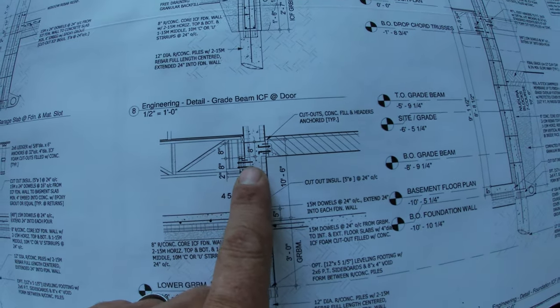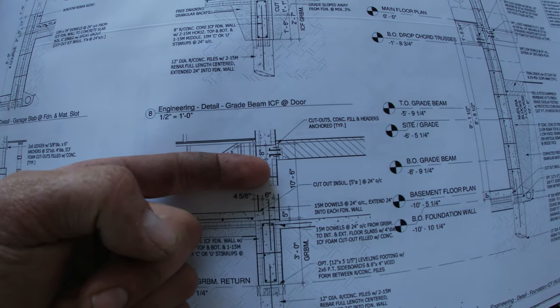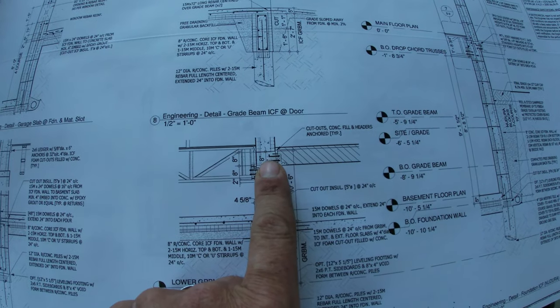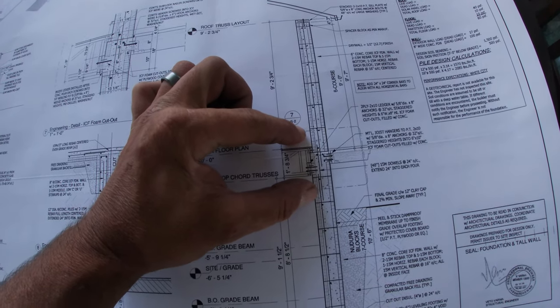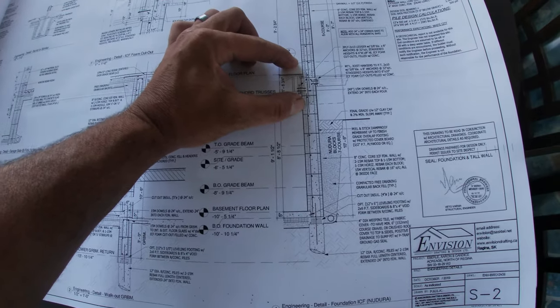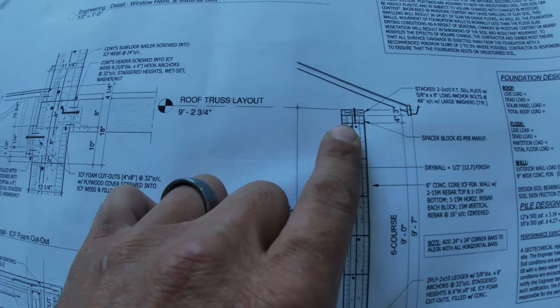of these cutouts that we had to put in so that we had a solid place to anchor these bolts into. Same thing on the outside here, there's cutouts there, so we have a solid place to anchor our deck ledger to. So that's how that all goes. This floor takes up a little bit more than a course, so that's why our basement was 7 courses tall, and our upstairs is 6 courses tall with a little 4-inch spacer. So that's how that all goes together.